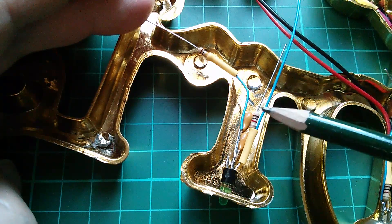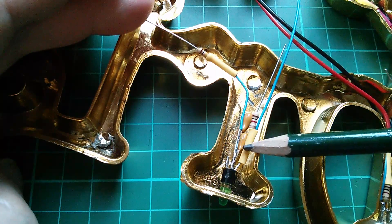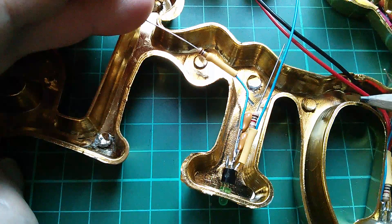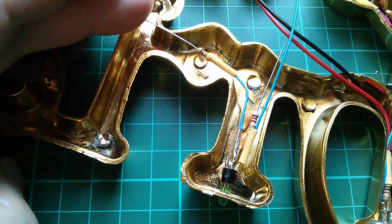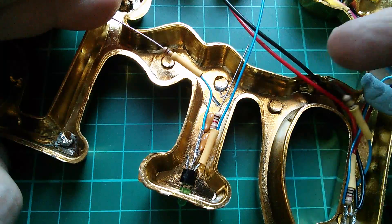I've got to keep remembering these things, otherwise I'm going to make a mistake. POS comes into that resistor, NEG actually needs to go down there somewhere so I need to get to that, and then this wire goes the other way to the next section's base. And there's the resistor there, ready to take it.